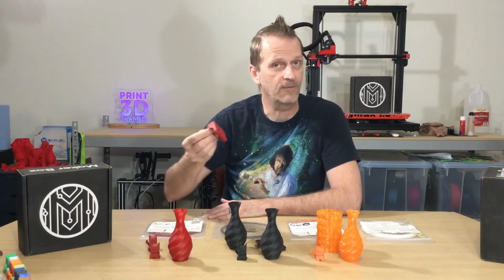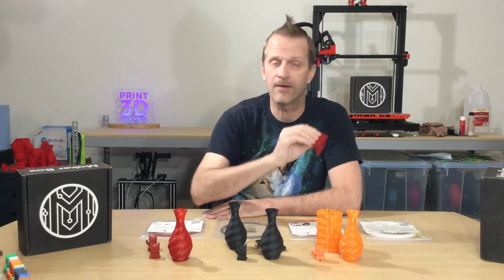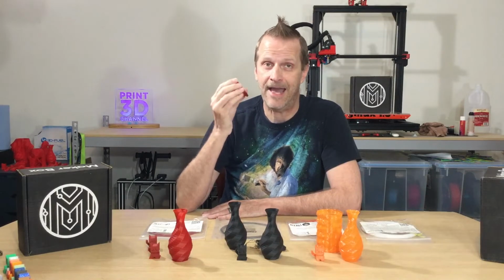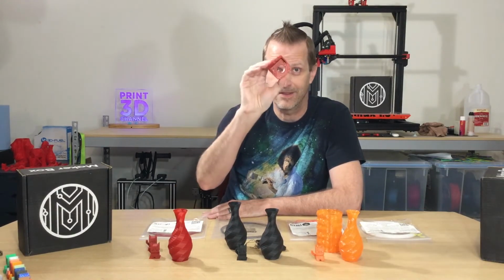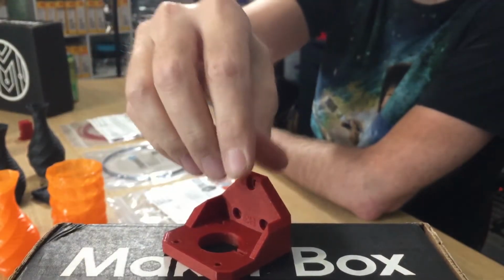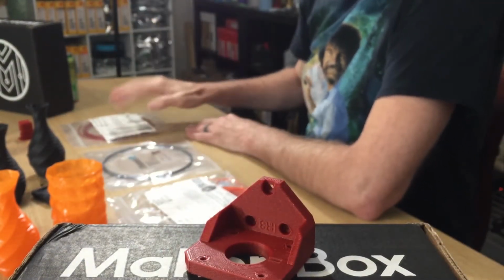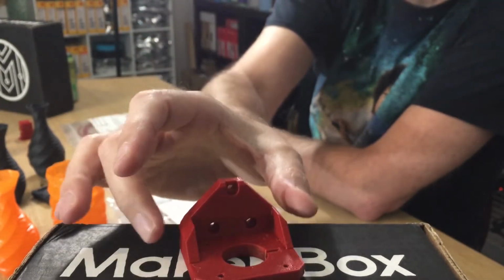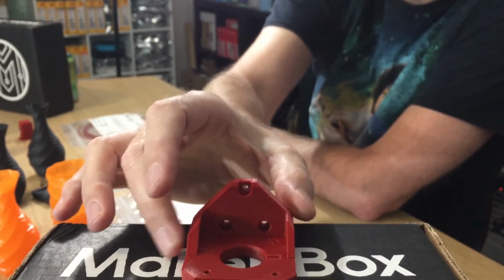And of course, the next thing we print out is the Prusa printer part. Now I'm going to be printing this with all samples that I can print with. And this turned out great. I can actually see a really cool Prusa clone printed with this type of filament, this actual Atomic Filament's Candy Apple Golden Pearl. It's a very odd combination of words. But this turned out great. There was no warping. All the top layers look amazing. There was, I think, very minimal stringing.